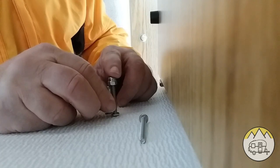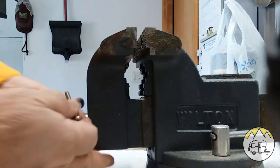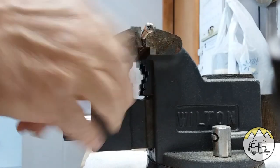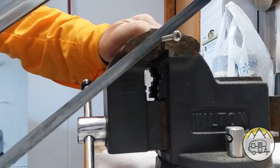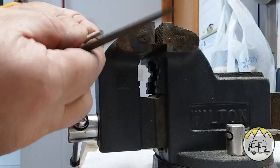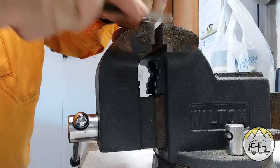I'm going to cut about an eighth of an inch off of it. I think it's just about an eighth inch off the end. I'm going to put that little eighth inch in the vise so that I don't mess up the threads behind there where the nut is going to attach. Tighten that up just a little bit. I'll take my hacksaw and saw right through that. Then I'm just going to take my real fine little file and file the little burrs off the end so the cap nut has no problem screwing on.